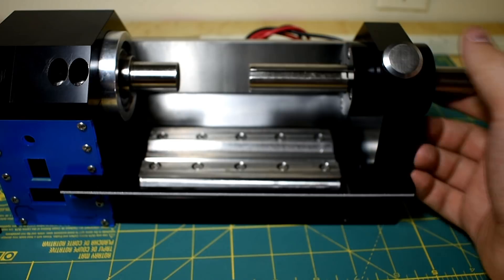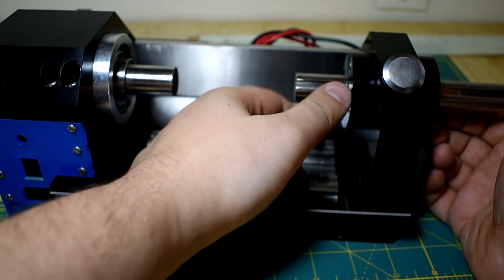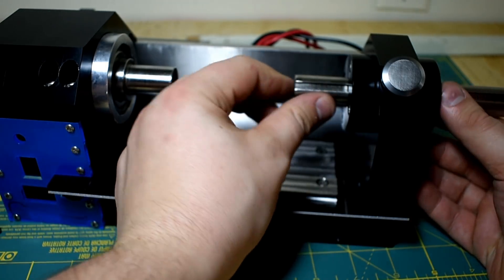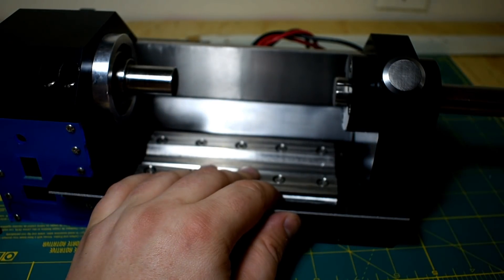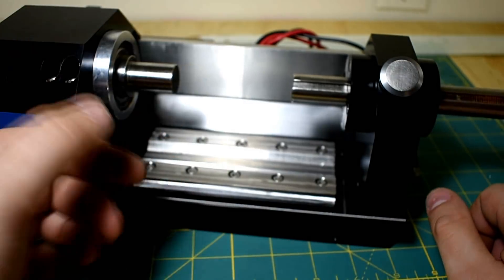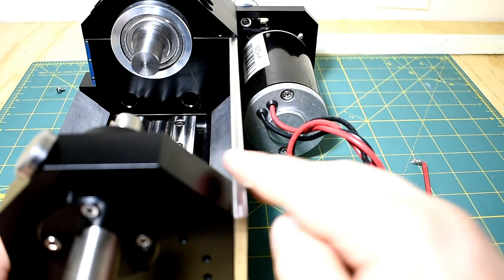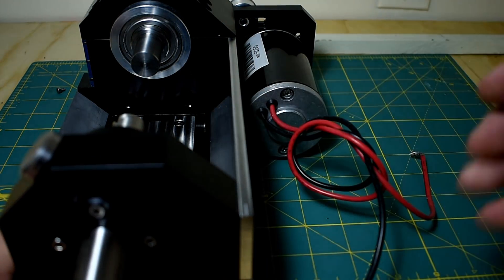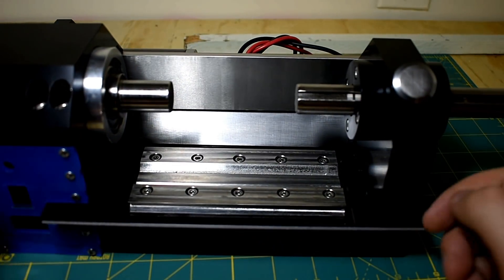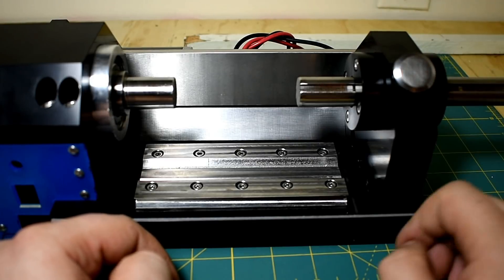That's starting to look a little more lathe-like. Instead of having an internal Morse taper on this, I'm going to have an external Jacob's taper. This tailstock is going to be used with a zero-to-quarter-inch Jacob's chuck. If I want to change something up, I can either make a new tailstock or make some kind of Jacob's chuck adapter. I was a little leery about drilling in and trying to do a taper on the inside, as I'm not confident in my ability to do that properly. This bulkhead thing here is quarter-inch-thick steel, so it's quite strong. The thought was that if it's going to want to flex, it'll want to bend in one direction, and such a large vertical mass of steel should make it nice and rigid in that direction.